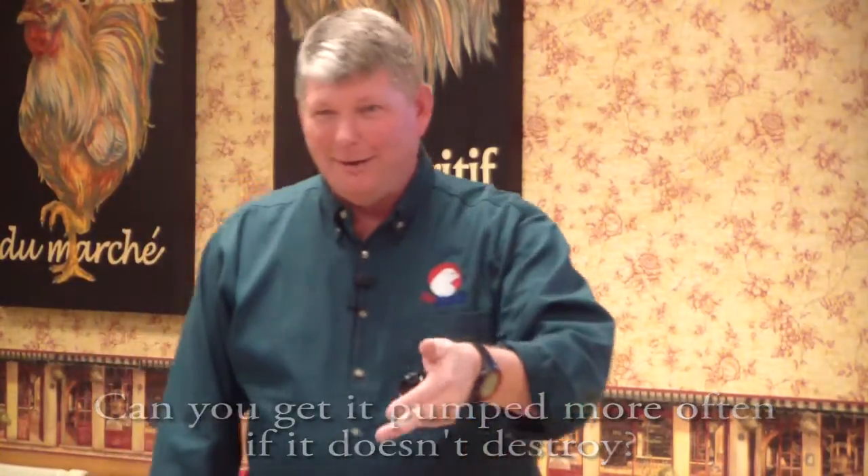And again, my home with my daughters — every couple, three years we're pumping a tank because you have that kind of an issue. More solids in it. And what happens when the solids build up, if you don't pump the tank, it eventually pushes solids out and you lose that capacity — the attenuation capacity, the ability for the liquid to slow down.